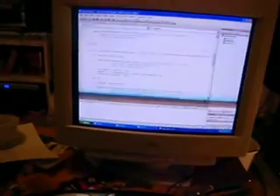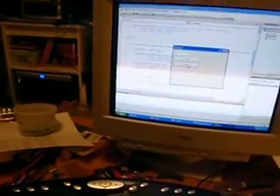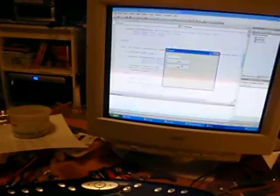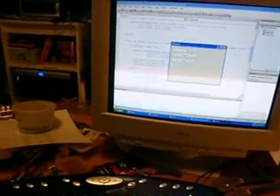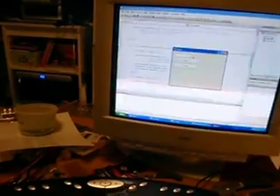Alright, we're going to show you how computer control of the pinball machine works. I'm going to start my Visual Basic here in debugging. I've got a start and stop button for certain solenoids for testing purposes. The text box will record our hits on the switches.